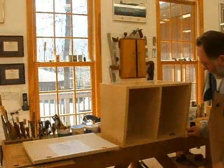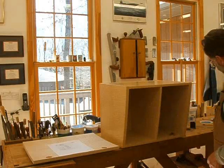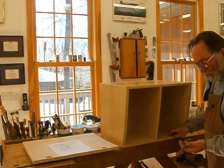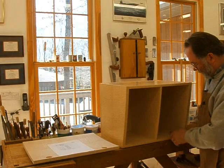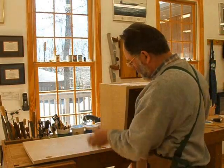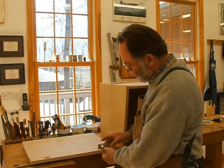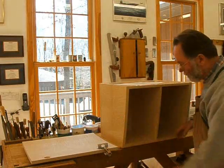Here's a quick explanation on how I attached these concealed hinges for the door. I have to attach a small mounting plate on the inside of the cabinet — I've got holes marked to drill. Once that mounting plate is attached, the hinge itself clips onto the mounting plate. This part of the hinge fits into the door itself, so the first thing I do is drill a large inch-and-three-eighths inch hole — not all the way through the door — and into that fits the hinge, which then gets screwed into place. You attach the hinges to the door, and then just clip them onto the mounting plates already inside the case.